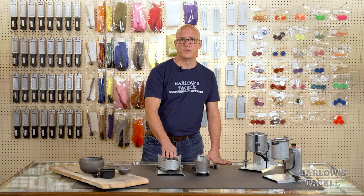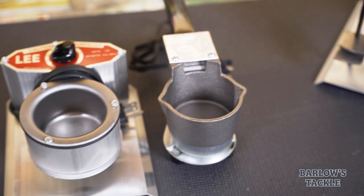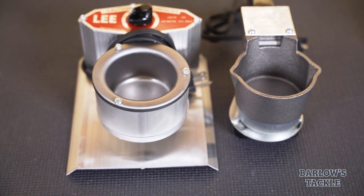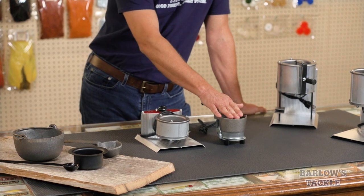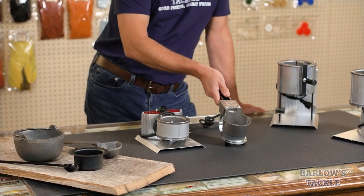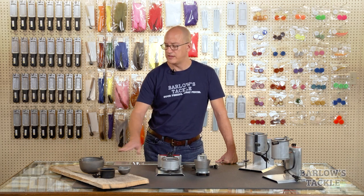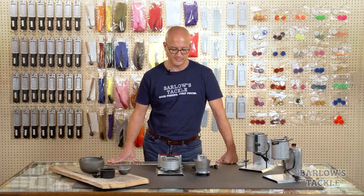Our next type of pot is an electric open pot, much like these. These are very similar to cast iron and steel pots in that you ladle the lead out of the pot, just like you would with those, unless you have a hot pot too like this one, which happens to have a built-in spout. Much like iron and steel pots, these are great for molds that have exposed wires, or if your lead simply isn't that pure, or if you're pouring anything large and heavy. These are still very affordable, though they do cost more than a cast iron or steel pot.